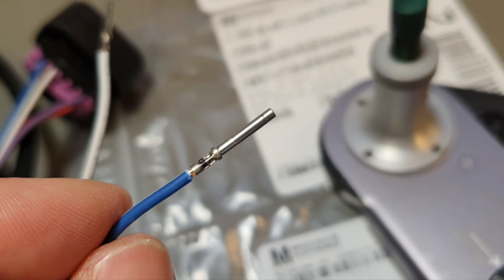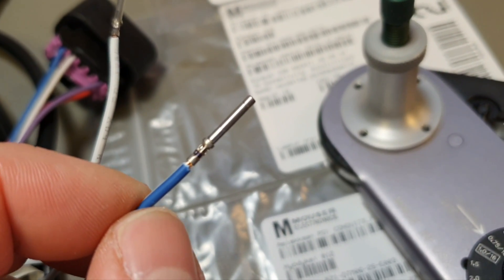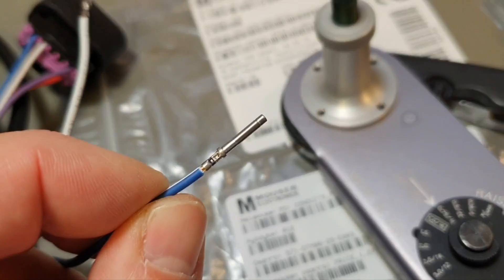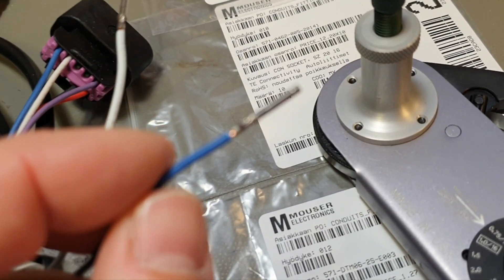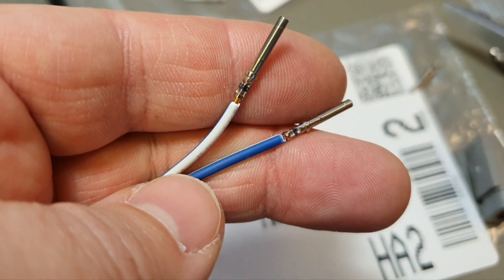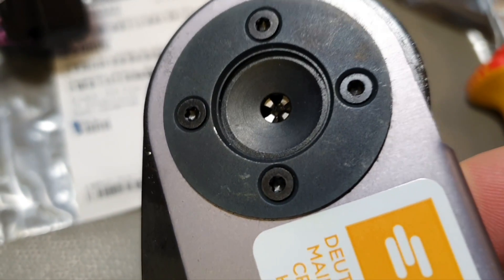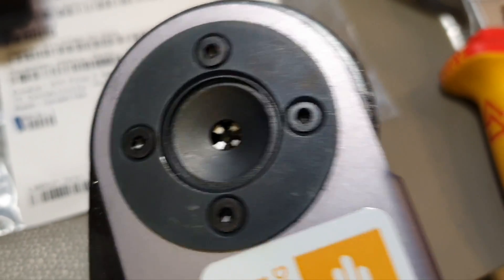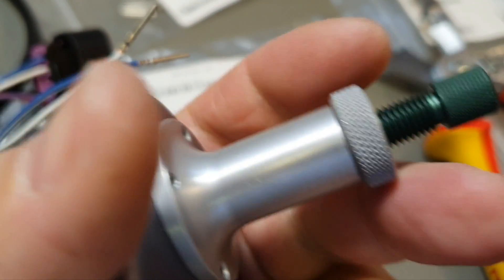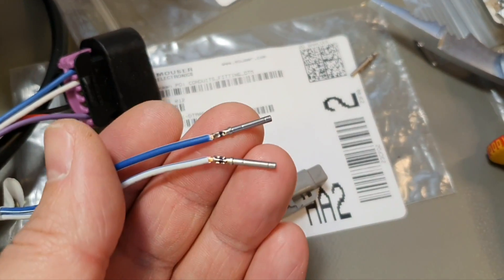I still don't like the result. I have more experience with DT and DTP, and I really feel that the smaller the gauge the worse the result to work with. The tool needs to be used a bit differently - you first need to adjust the tool to fix the contact correctly, check where the crimping area will be, do one crimping, check the result, and then you have the tool set to the right position. It's a little different than working with DT and DTP.